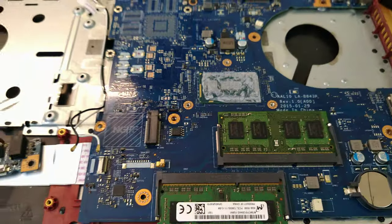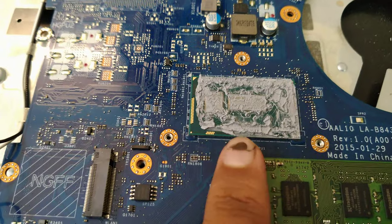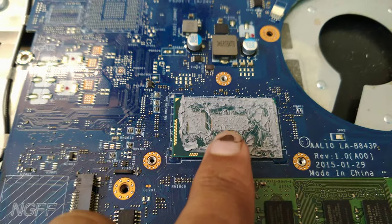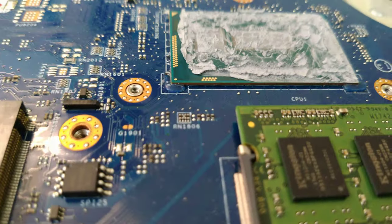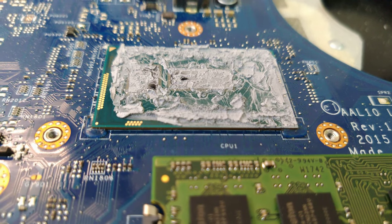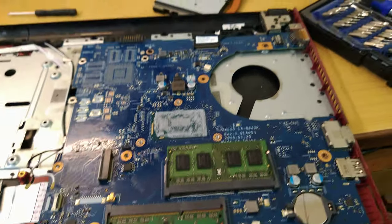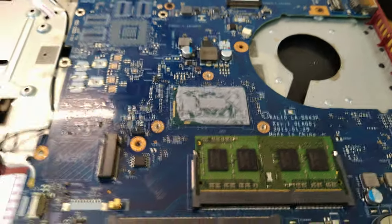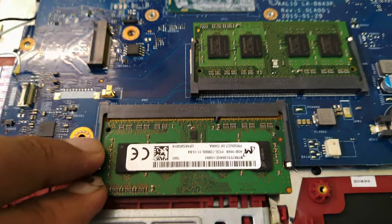What's interesting is this is the actual CPU with a GPU die — the bigger one is the GPU die and that's the CPU — on a BGA, since it's all an embedded thing. Mostly these cheap laptops are basically just single board computers with things attached to it. I could take this particular board out and use it as a generic single board computer running Intel Pentium.